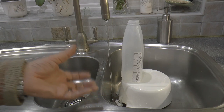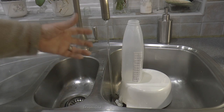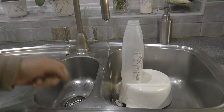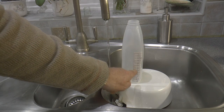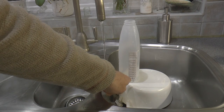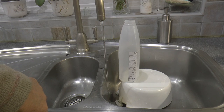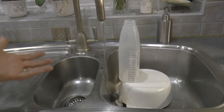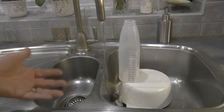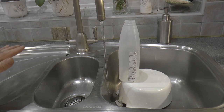And the block is raised by a temperature proportional to something called its specific heat, which is its ability to absorb energy, heat energy. So this temperature is a measure of the energy that's going in. Now you'll note that the calorimeter is sitting at 10 degrees at the moment. That's, let's call it, ambient room temperature. Unless you go to some extreme lengths to force the temperature of the calorimeter down, it will always have a base temperature of some sort.